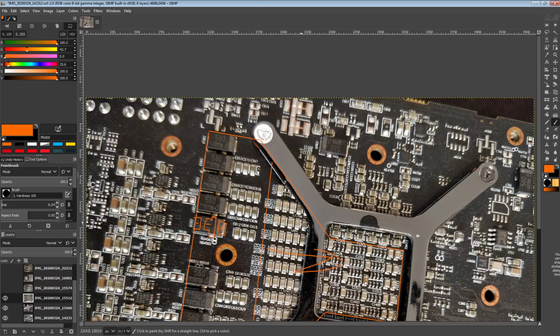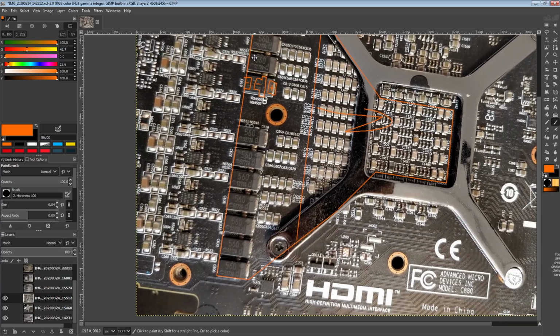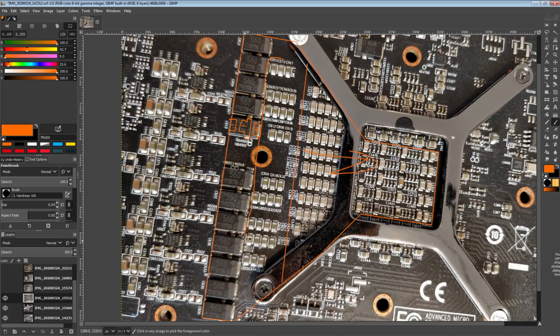So generally, for these capacitors you'd want 105, maybe 85 degrees. At lowest you'd want an 85 degree rating. I normally buy mine at 105 degrees. And a lot of the time you'll see the capacitors right by the actual MOSFETs be 125 degree temperature rating. So anyway, that's the output filter here. We've got the really expensive 3-terminal aluminum polymers and then a bunch of multi-layer ceramics.